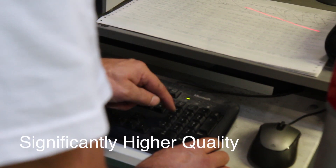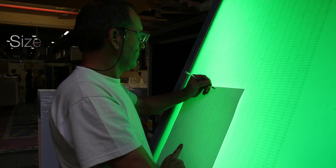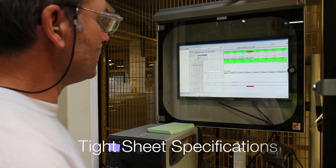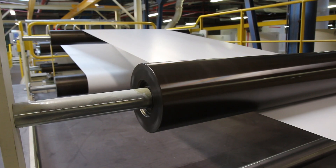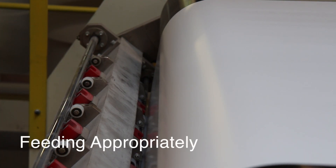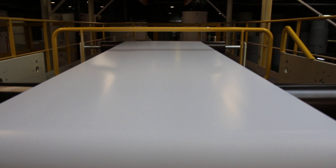Digital printing necessitates significantly higher quality requirements than traditional offset printing. In particular, the size and squareness of the paper has a particularly low tolerance. The precision digital cutting line ensures very tight sheet specifications and perfect squareness whilst eliminating edge welding that leads to printer jams. Sheet squareness is critical to printing machines feeding appropriately and delivering consistent registration from back to front and page to page.